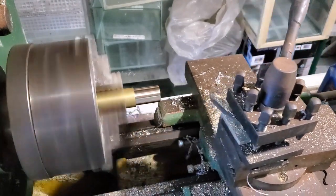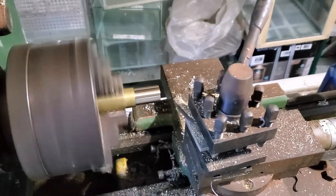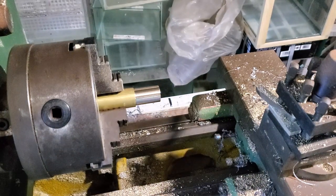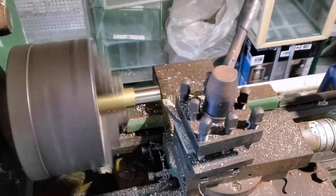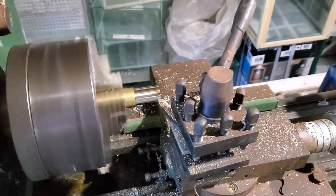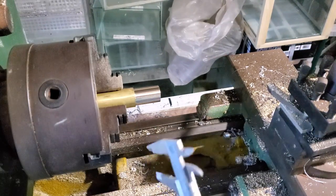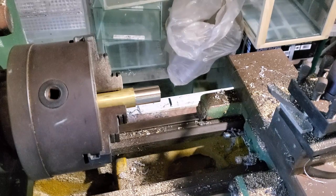Getting closer to the end of this — this took quite a while. The part that was just a little too loose: the difference between where it doesn't go over at all and where it's a little too loose is two thousandths of an inch off the radius. I'm going to approach that as closely as I can to get a nice even fit. The difference will be less than one thousandth of an inch off the radius — very fine, finer than I usually do with my lathe because it is an old machine. Now it has no wiggle room — it actually does just fit over.